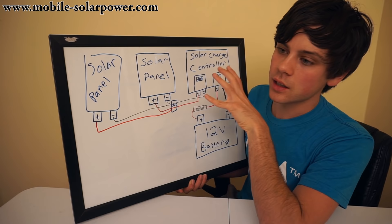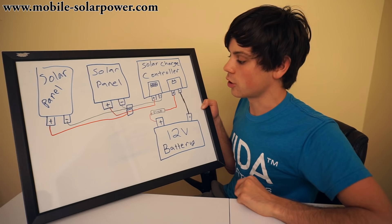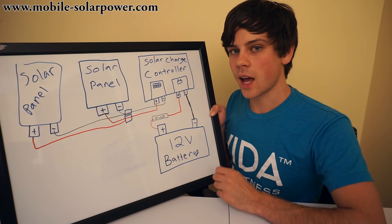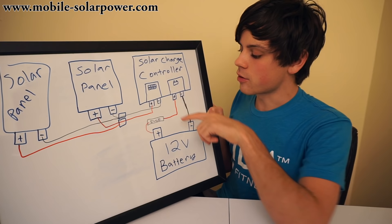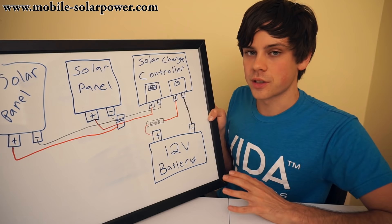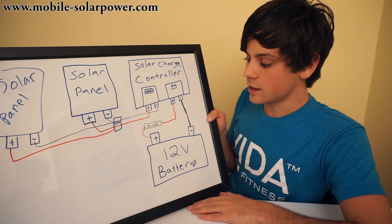So we have a charging system. We can charge up this battery, and it will charge in a few hours depending on the size of the battery and the size of the solar panel array. But how do we use power from the system? People will typically want both DC 12-volt and AC 110-volt. For an inverter, it can be attached directly to the bolt-on fuse if the fuse is large enough. Most inverters come with a fuse, or you have a bolt-on fuse on your system already. Reference whatever the manufacturer recommends. The inverter is easy — you can buy cables with a built-on fuse and wire it straight to the battery.